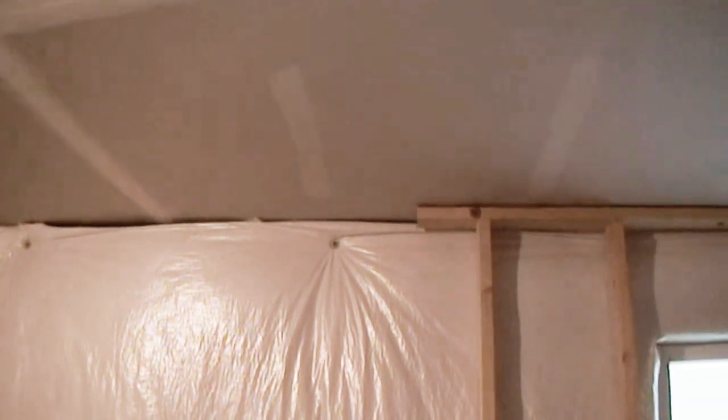Are you going to be trying to line your studs up with those? Well, no, I don't want to. On the other walls that you're going to put up? All the way down? And this is already determined, because where these is determines the next one. Right. That's at 8 inches. Everyone going down will start at 8 inches. Mathematically, those boards will be 7¼ both.